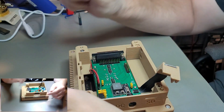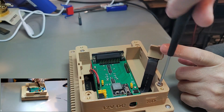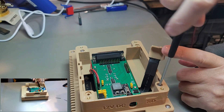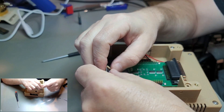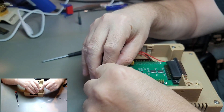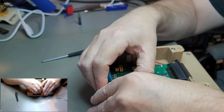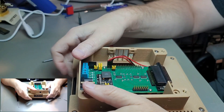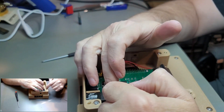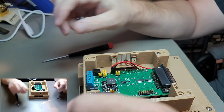This is the tricky part because it's a tight fit. When manipulating the cable it can come loose from the Pi below, meaning you won't have the SD card. Push the tray all the way down into the corner. If the cable does come out from the Pi, you'll need to pull both pieces off and reseat it — at that point you may just want to hot glue it in.